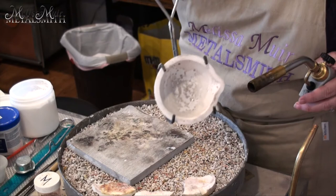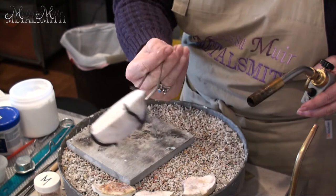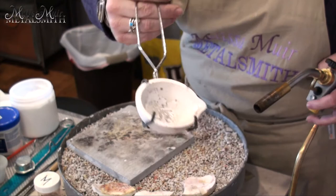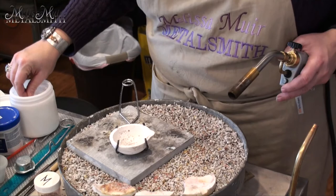Now at this point, you can easily see where that flux is beginning to coat and where it has pulled away from some of the crucible edges. We're starting to get a nice grayish coating in here, and that's where the flux is beginning to turn kind of glass-like. Because I can see several open areas, I'm just going to take some of this boric acid and sprinkle it into those areas.